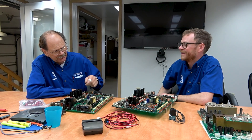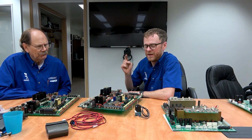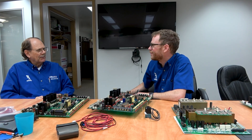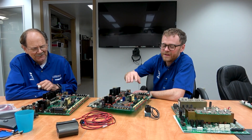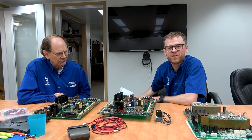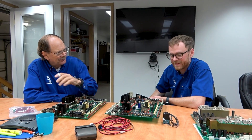We made a kit — this was 20 years ago — with all the cables and the plug on the outside of the machine and everything. If you're trying to add a spindle air blow, or guys who want to have a Harbor Freight pressure washer for high pressure coolant — they hook up a Harbor Freight pressure washer to their coolant tank and put high pressure coolant through the spindle. If you want to turn on something externally from your machine, there are four relays that you can command. You've got M codes to turn them on and off, with a normally open, a normally closed, and a common.